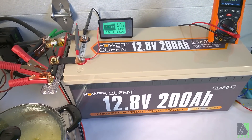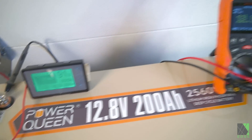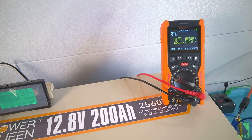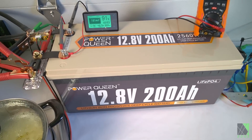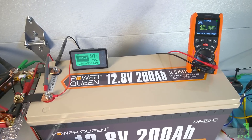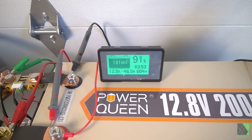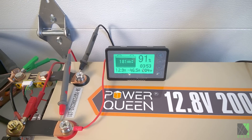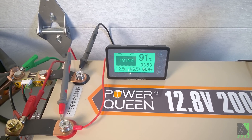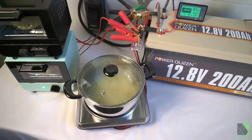How is the battery performing under this load? I'm drawing about 46.5 amps, and the terminal voltage is right around 12.94 volts. This battery is mostly charged, or at least it was when I started the test, and the numbers look about right to me. At this moment there is no charging from the sun, so the solar panels are not helping the battery at all. According to this meter, I should be able to run these appliances for 3 hours and 53 minutes.